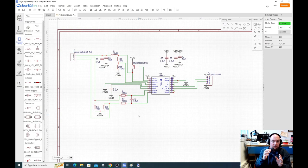And we move over to the PCB side. In that side, instead of dealing with the symbolic library parts, we'll be dealing with the actual footprints for the packages. The problem is, once you get to the footprints of the packages, they're really abstract. You'll see two little squares of metal. You don't know which square of metal is which. It's hard to tell what connects to what. That's why we do all of our connections in the schematic.